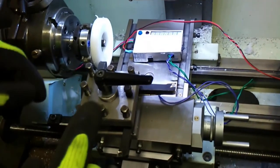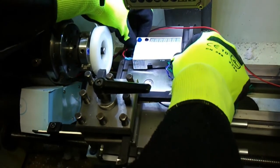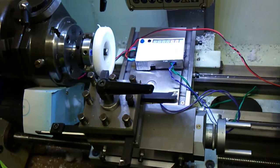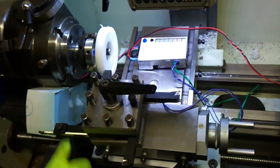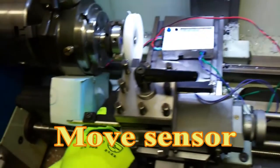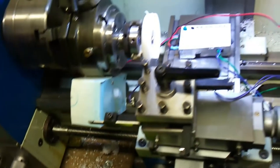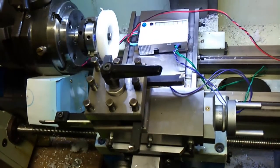Now we have to enter full mode, 50 positions, so we enter 50, press next, it's set. But these are the small stripes, so we move the limit sensor a little bit shorter. And now we start cutting — this is the first cut, going back.